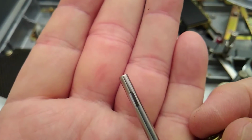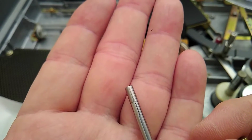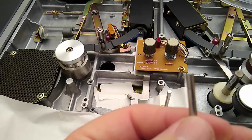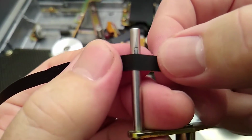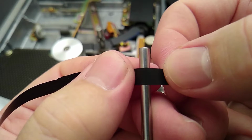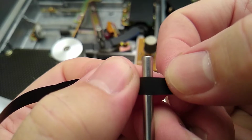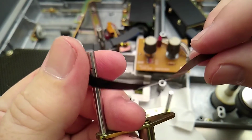I've got one of the lifters off here, so you can see that groove right there. And you can see, if you look close there, I already scraped some off, but there's oxide deposits on the dang thing. And then, like I said, I tried to fit some tape across here. The camera's never going to focus on, maybe it will. But I feel like that's catching the bottom of the groove, but it's outside of the top. And then if I go down and catch the top of the groove right there, it just feels like the tape's very slightly wider than that.